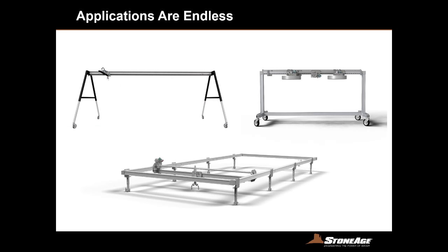Here are pictures of those different options. The top left is our bundle blaster display, and over to the right is a conveyor cleaner. The bundle blaster can be used in all kinds of different ways to cover a large surface area. Using our blast track rails, this can go in an X, Y, and Z function — at any pressure, any flow. That leaves us with the end of the surface preparation section.